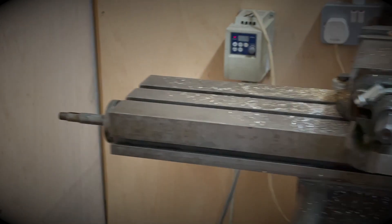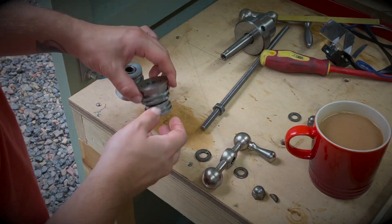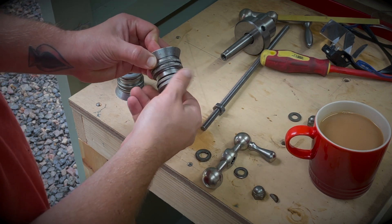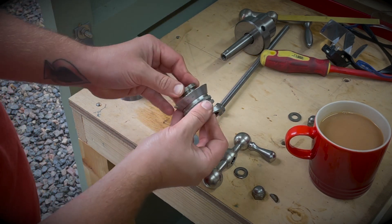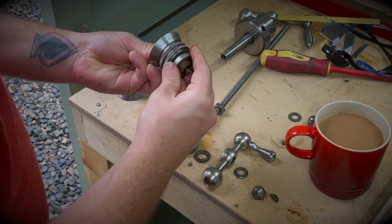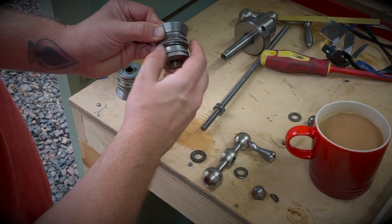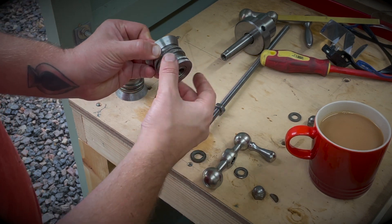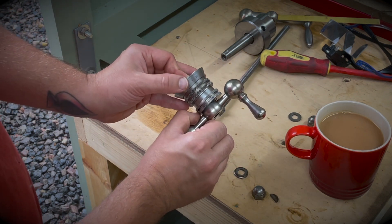So I decided to take off the front dial as well and I've got them over on the workbench. This is what the resettable dial should look like. There's a nut here with a screw thread on the inside which screws onto an internal arbor, and then the dial is on here. So when this all goes together you can screw it, and when it's screwed in everything's free to rotate, and when you push it outwards it pushes onto the back of the handle and locks the rotation of the dial with the rotation of the handle.